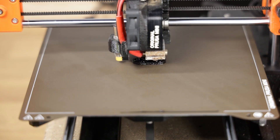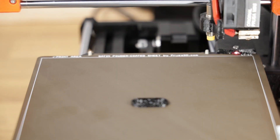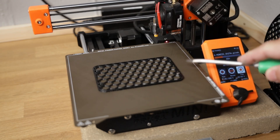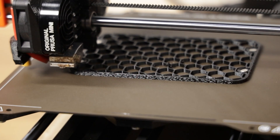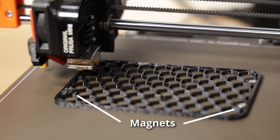I'm going to go over how to design the model and how to pause the print so you can add the magnets. There are two main ways to add magnets to a 3D print. I call them exposed magnets or embedded magnets. Exposed magnets are easier to design since all you have to do is add the magnets after the print is complete. The design tips I'm going to talk about are useful for both exposed magnets and embedded magnets.